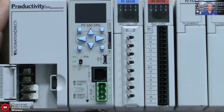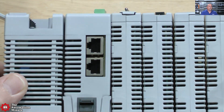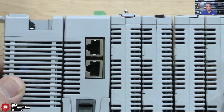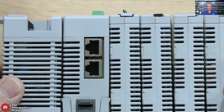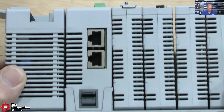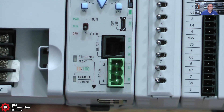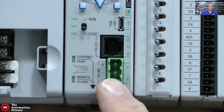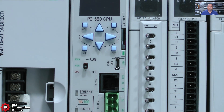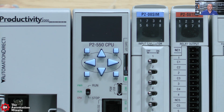I looked up some of the specs on this. First of all, it has five communication ports. The Ethernet ports are on the bottom — the one towards the front supports 32 Ethernet IP devices or Modbus TCP devices, which is pretty cool. The one in the back supports AutomationDirect remote I/O devices like their VFDs and I/O. On the front we have a couple of serial ports — the RS-232 and the RS-485. And then you can see the USB programming port. We can also see the SD port, which supports a bunch of features including data logging, so you can data log right from the CPU to that SD card.